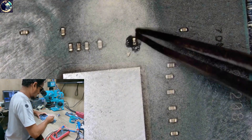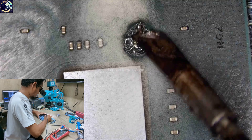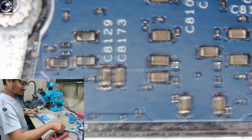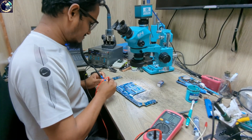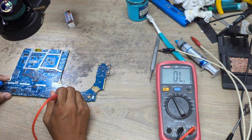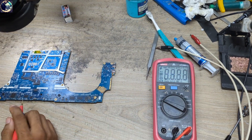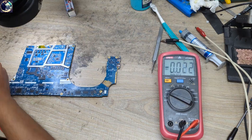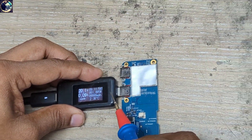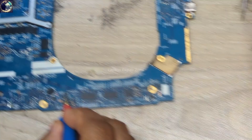We're really lucky this time! Let's check the impedance again — it's not beeping anymore. Let's plug it in and it's turning on! Now it's drawing about 2 amps and 3.3 volts is available.